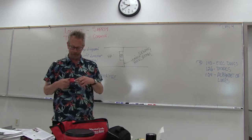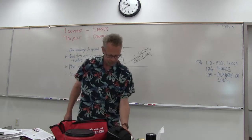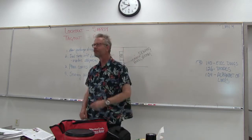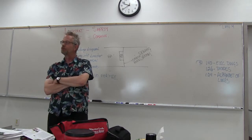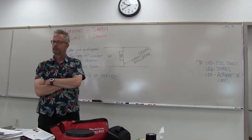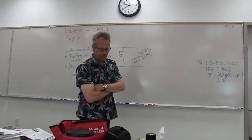One day I had a lockout on a circuit, went home, and forgot to remove it. The next day I wasn't at work, so they called me before removing the lock and asked what status I was in. I told them the last step that needed to be done, they finished it, then removed the lock. There shouldn't be more than two keys — it's serious business. You should never share a lock with somebody.